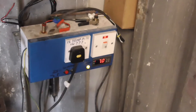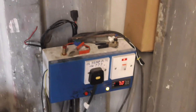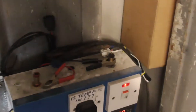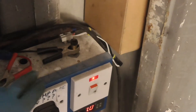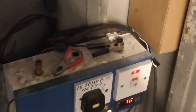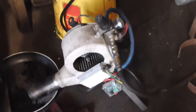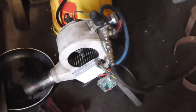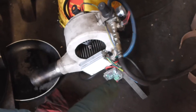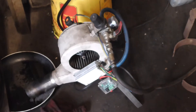So I've got a main wall plug which feeds it all. Inside there I've got a 12V converter and I've got two pins on the top - one positive, one negative - and they supply the burner with 12V. Because the burner is entirely 12V and therefore could run off a battery. And now that it's got the heater on it, I could run the whole thing remotely off a car battery.